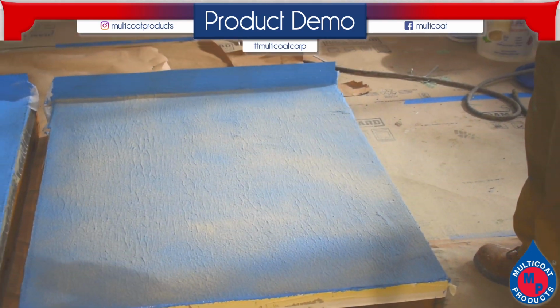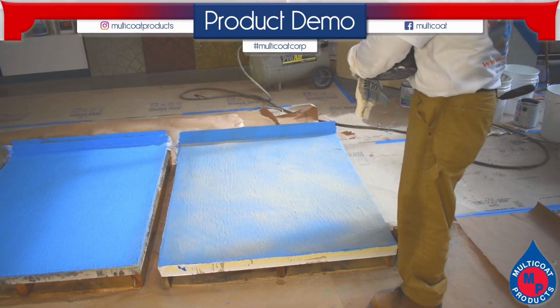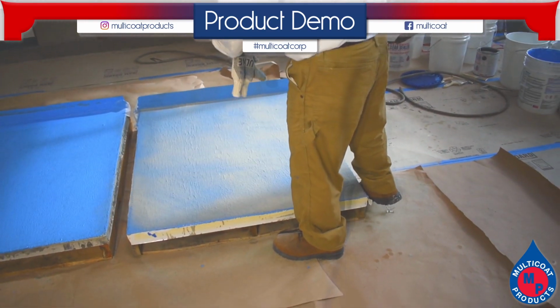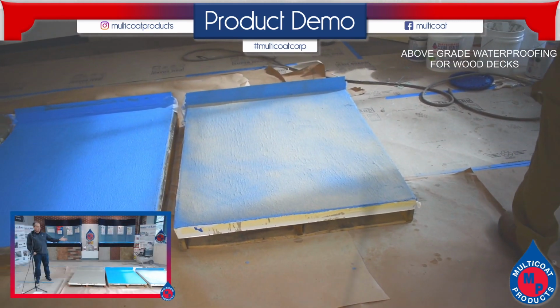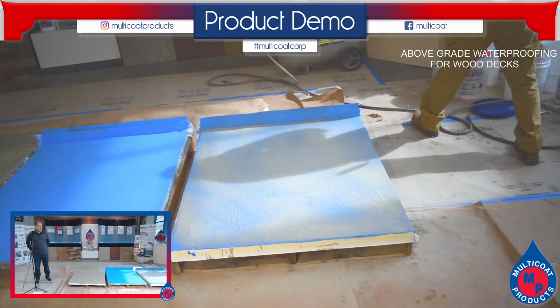So when you do the second coat and it's still wet, we want you to broadcast sand on the Multicoat. What you do is broadcast sand, and then you come back a couple hours later when it's dry, and you take a blower and blow off any loose sand. What the sand does is, when you put your concrete coating over the Multicoat, it gives it a better mechanical hold because Multicoat's kind of slick.